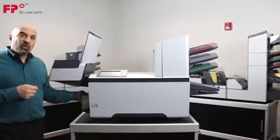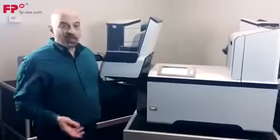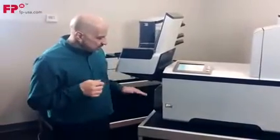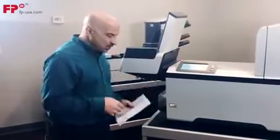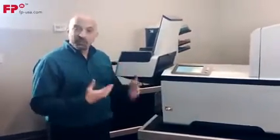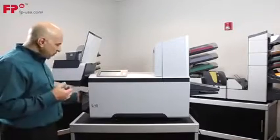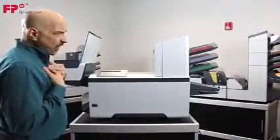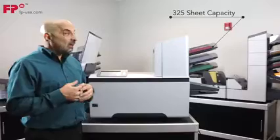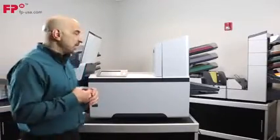There's a lot of options and flexibility with this machine, such as our envelope popper — a load-on-the-fly envelope popper that holds 325 envelopes. It pulls envelopes from the bottom, which means the user can set a stack of envelopes on top continuously to keep the machine going. Our feed trays are also load on the fly. We have feed trays that hold 325 sheets, some that hold 725 sheets, and one that holds up to 1,200 sheets of paper. Continuous operation is the reason people buy these machines — productivity is important.